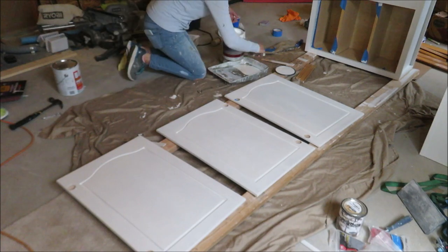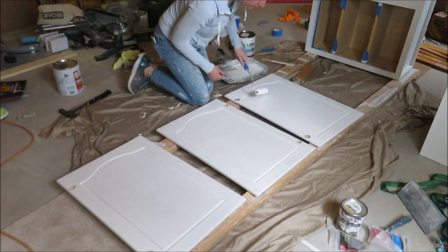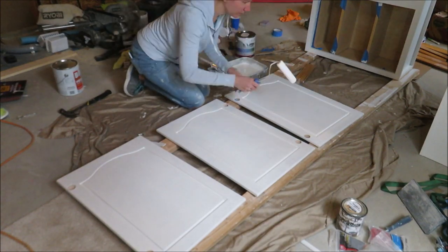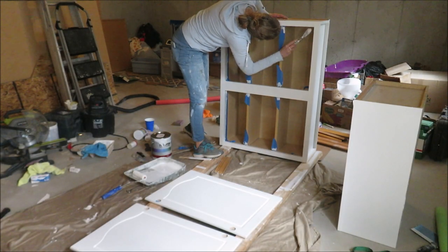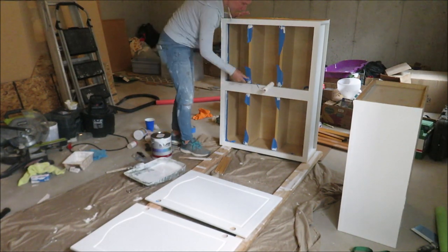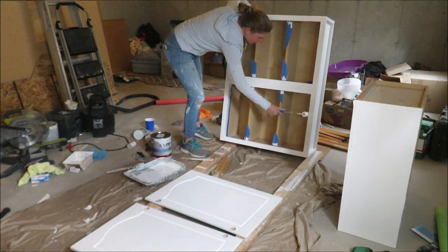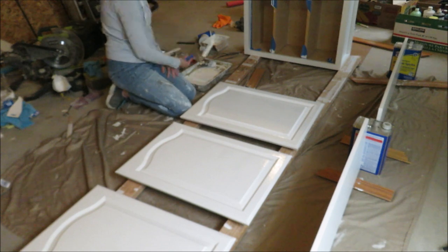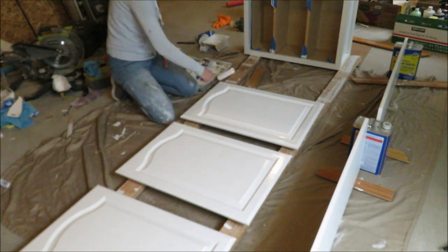For the actual cabinet paint, I'm using Benjamin Moore Advanced in the color Chantilly Lace. There are so many shades of white — I went with this one to test it out. It came out a bright white, which is what I wanted, though I'm not sure if I'll use it for the kitchen. This paint is self-leveling so you don't get brush marks or roller marks. The downside was a 16-hour recoat time — I painted the first coat, waited 16 hours, lightly sanded with 320 grit, did the second coat, then waited another 16 hours to flip them and do the front sides. The whole process took several days because of that.